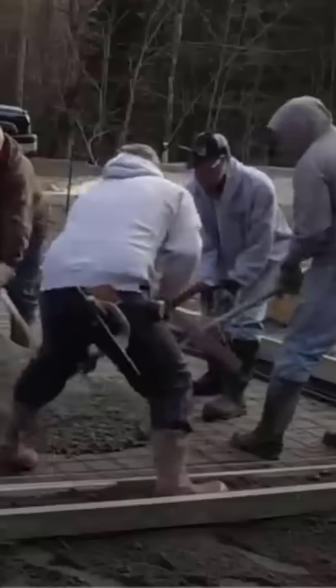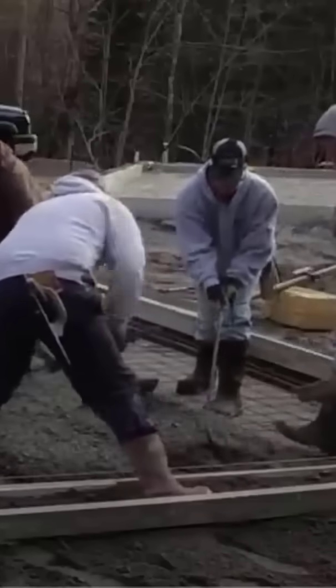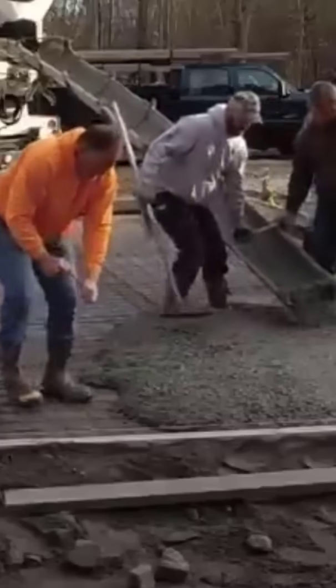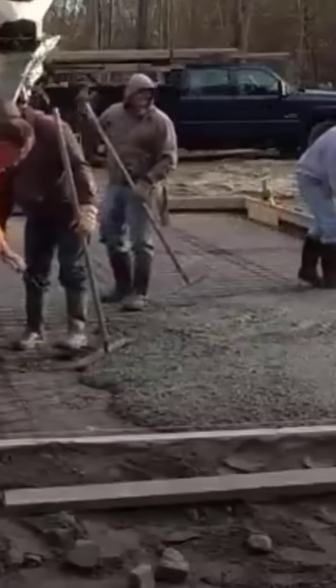As you can see, we pull the wire mesh up into the concrete as we pour, and it does not go back down to the bottom when you step on it. That's for the wire police. Now the slump police think that if you pour wet concrete, it's just going to break up and not be any good a year from now — but they don't know that there's an additive called water reducer that you can add to concrete.